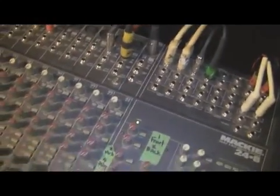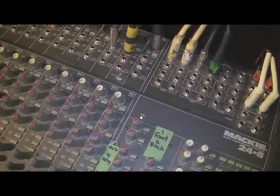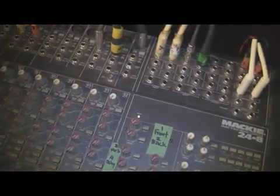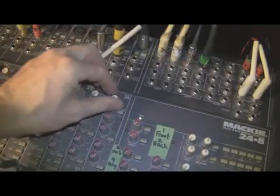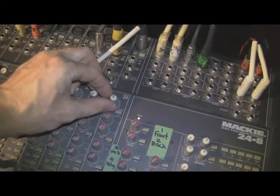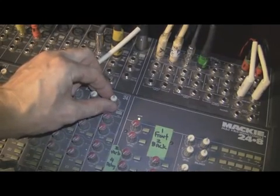First step now is we'll keep an eye on this gain. As I stated before, I have my channel at +5. I have the master at 0. I start to increase the microphone through the sound system. Now you can hear it loud and clear.